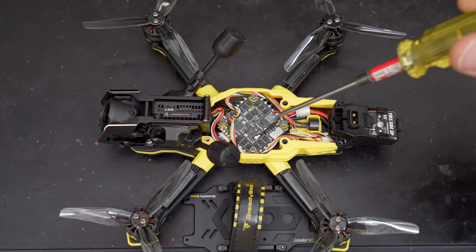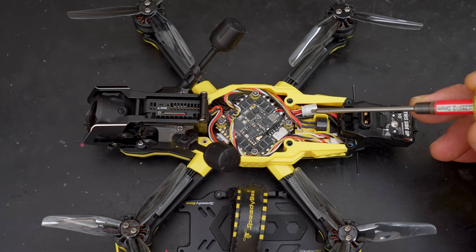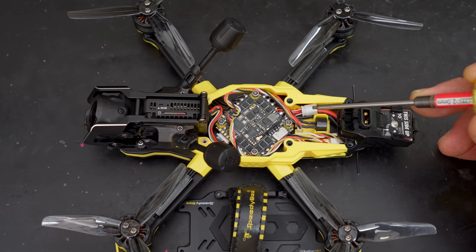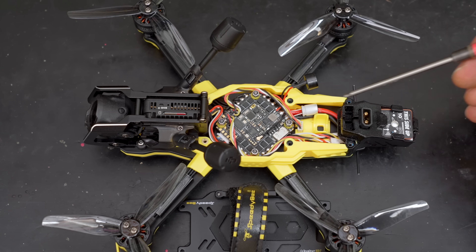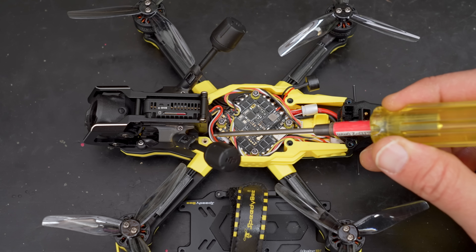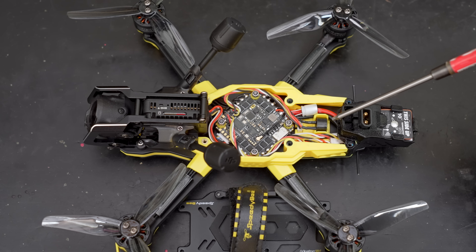The flight controller is Speedybee's F405 all-in-one board with 40 amp ESCs — an 8-bit ESC running BlueJay firmware. There's a wireless antenna so you can connect to the Speedybee app on your phone and make tuning changes in the field. There's also a 220 microfarad capacitor soldered directly to the ESC's battery pads, which is the right way to do it and nice to tick off the list. In the back there's a buzzer anchored in its own niche, making it much easier to find your quad when you crash in tall grass. The solder work looks very good and in general the build quality is excellent — they've crammed a ton of features into a small amount of space.